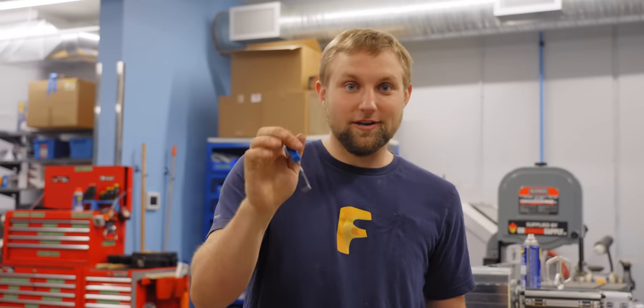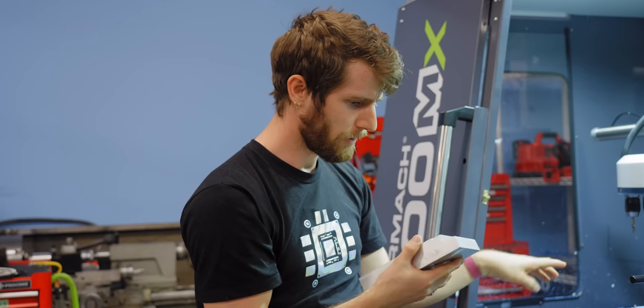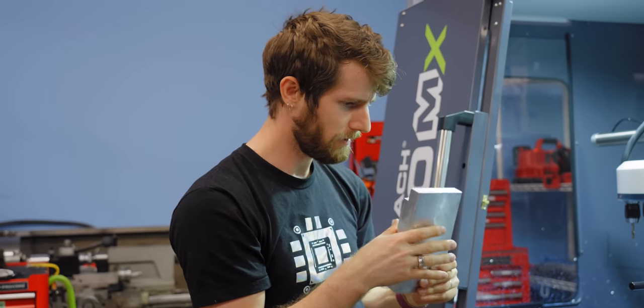Nothing quite like a brand new machine running brand new bits, eh? Why that finish is so good is because when you plow a tool through a part, it's gonna naturally deflect. And the router, it's just so big, it can't be rigid. This little tool, it's a lot denser and a lot heavier, so it deflects less and you get a better finish. Yeah, it's absolutely incredible. Almost as incredible as my segues to our sponsor.